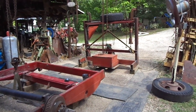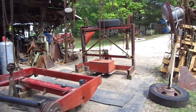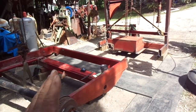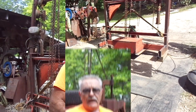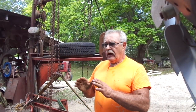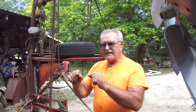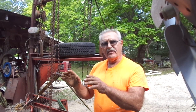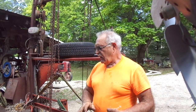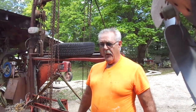Right now I'm using four at one particular time. The first part of the video, you saw my son and myself cutting all this thing apart. Now it's going to be trimming up all this nasty stuff and actually cutting it back to where we want to make the repair or have the repair begin. I've got my notepad out, and I took the actual dimensions of everything before we cut it apart so we know the exact dimensions to go back with. Once I get things tacked in, we'll square everything up and make sure that the dump bed is going to sit squarely on the frame whenever we raise and lower it. So now we're ready to go ahead and address the remaining portions of what got destroyed in it coming apart.